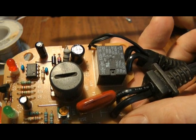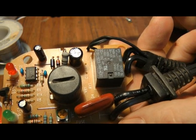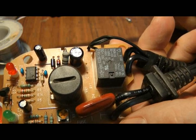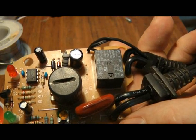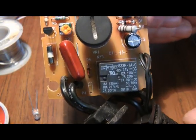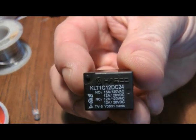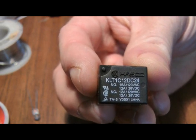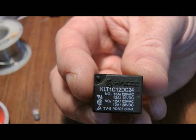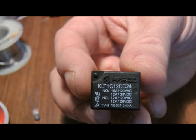Other sources of this relay — Potter Brumfield makes some relays like this. I'll put in the text below the video on YouTube some of the names of the suppliers. allelectronics.com is a salvage supplier source, and electronicgoldmine.com is also a supplier source for a lot of relays like this. The relay I'm going to be replacing this with — I think that's a fairly off-brand. This is another off-brand; I think this might be Hitachi, I'm not sure. It's a very strong relay, it's 15 amps, and this controller is rated for 600 watts, so this is actually over the rating — actually it's over 1000 watts, so this is fine.